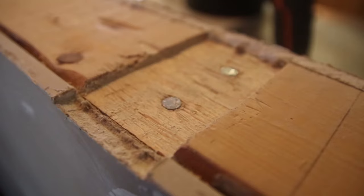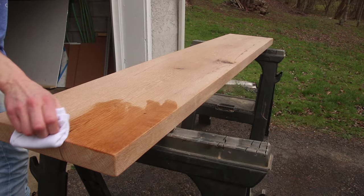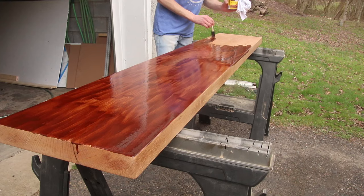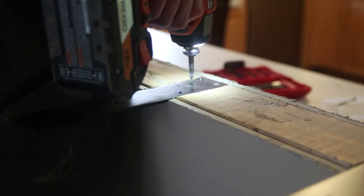With all the metal ready, it was time to focus on the wood. After getting all the holes filled with the Starbond adhesive, I sanded everything really well all the way up to 220 grit and wiped it down with a tack cloth. Then I added a coat of pre-stain before applying the stain — this is the first time I used pre-stain and it worked really well, bringing out the wood grain nicely. After applying one coat of stain I wiped everything off with a dry rag. Off-camera I also applied several coats of lacquer on the top.